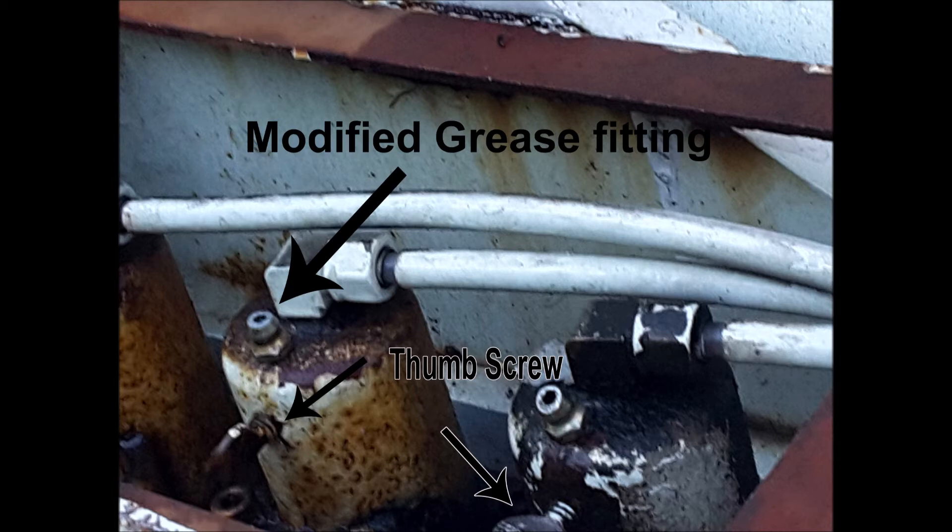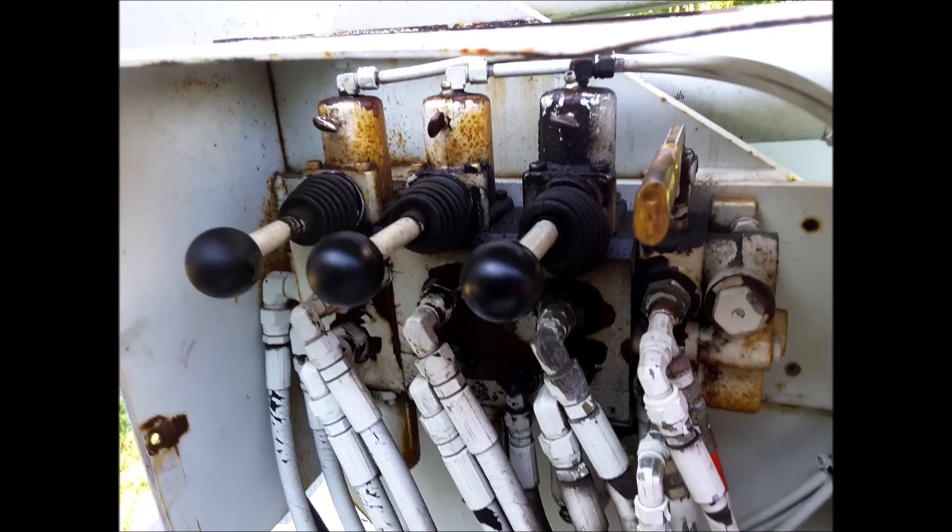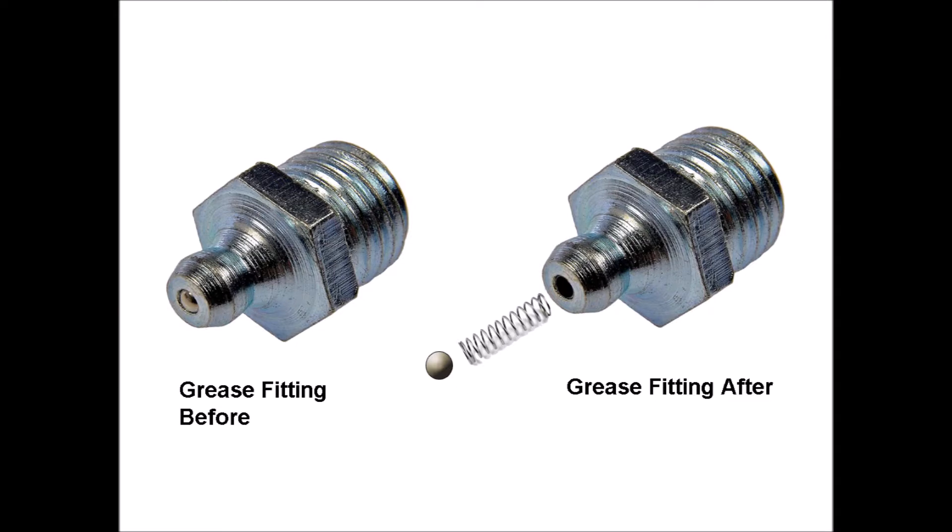So what I did was use some of my grease fittings. You have to experiment to get the right size that can thread into the existing drain holes. Some of the holes I had to thread using a tap to get the fitting to thread in. Grease gun fittings are no good unless you remove the check ball and spring inside, which is easy to do — just grind off the face lightly and use a nail to punch out the innards.